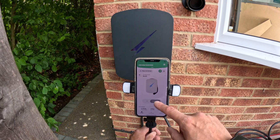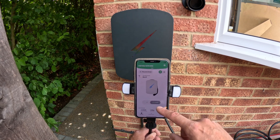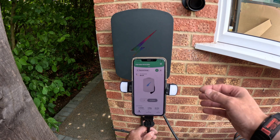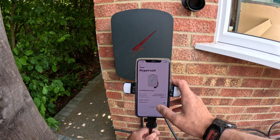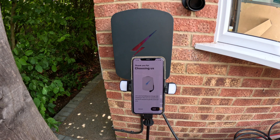There's also a start and stop button. If you have a car plugged in that needs charge, you can start and stop it right there — simple as that. Once you've carried out all your testing, you need to go back into settings, go into your Hypervolt, and unadopt. This means my commissioning is done and my customer can now download the app and adopt the charger themselves.